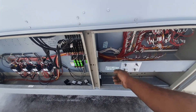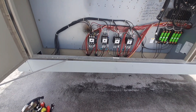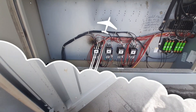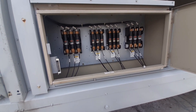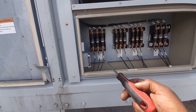Let's go ahead and turn stage one on. Contactor engaged. Maybe we got a blown fuse for the compressor — hopefully we didn't burn up any wires here, because then we'd need to pull a new wire. Stage one is these big fuses over here.